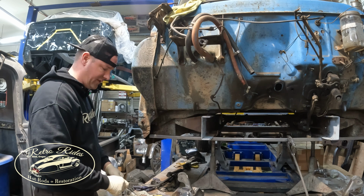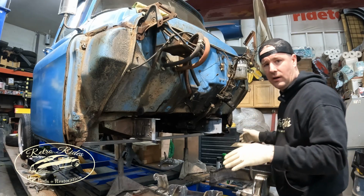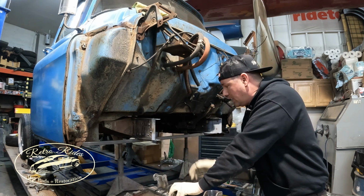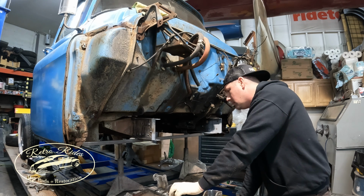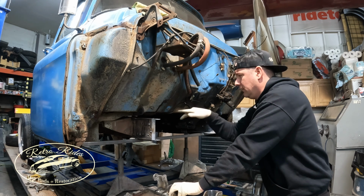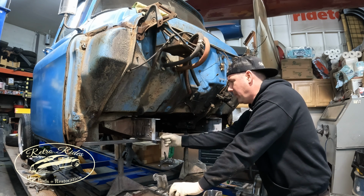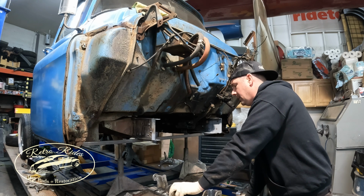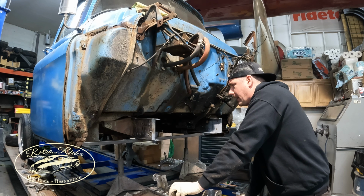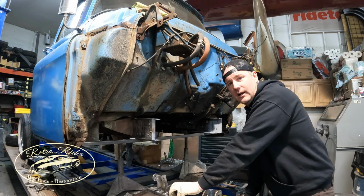All right, with any luck, this frame rail is the same width and whatnot. Frame rail slides right on the top, but the opening in it is about an eighth inch off. So I think what I'm going to do is drop these lower plates off of here. That way we can have something to hang on to, and then I can still come back and burn it in on the inside. That'll probably be the easiest thing to do, but evidently it's not exactly the same as the original frame rails. Shocking, but that's why I didn't burn it all the way in.